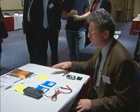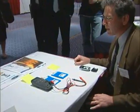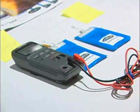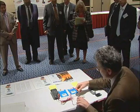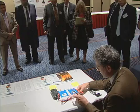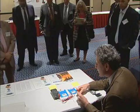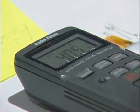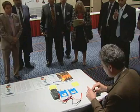I'd like to get everybody oriented as to what I have in front of me. I have a multimeter — basically a voltmeter. I took the small prismatic battery out of my cell phone, which is a three-and-a-half volt rechargeable lithium battery. By putting the probes of the multimeter on there, I'm getting a four-volt reading, approximately what we would expect from this fully charged lithium battery. I'm using this as a reference point — four volts on this.